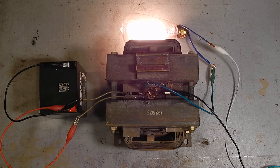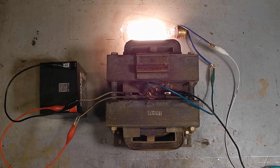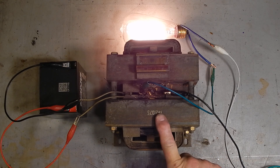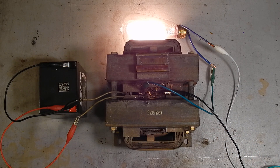And perhaps some of the windings to make a large transformer. I hope to be able to push at least 200 amps with this, and then the primary will be connected to the remaining saturable reactor so that I can adjust the current of the welder. I'll probably have a bypass switch for full current and then several settings on the saturable reactor for a finer adjustment of the welder current.